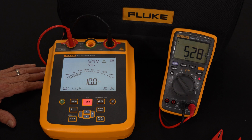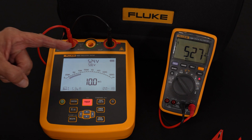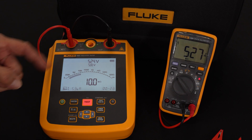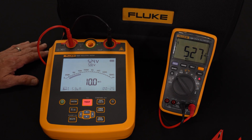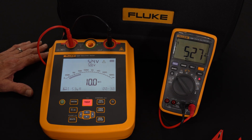The test button will light up, and in the bottom corner we have a counter started in terms of time. Why am I using a multimeter? It's an easy way to illustrate the capabilities, because all Fluke multimeters — most multimeters — have a 10 megaohm input impedance, so this is going to act like a 10 megaohm resistor. At the top of the display you'll see the voltage range selected, which is 500, and the actual voltage output. This is considered a true megohmmeter — it measures its own output, and it's obviously within a few volts of what the Fluke meter is showing.